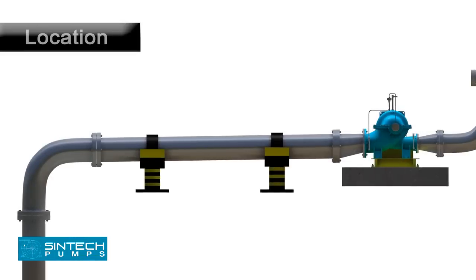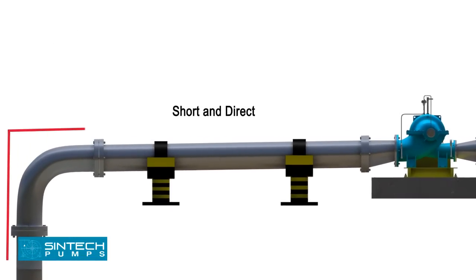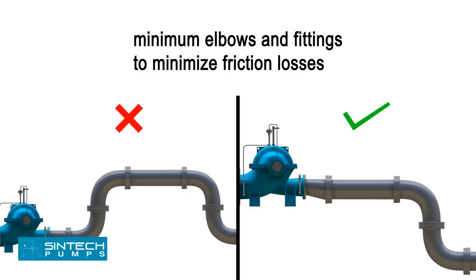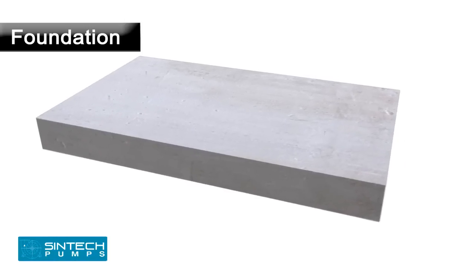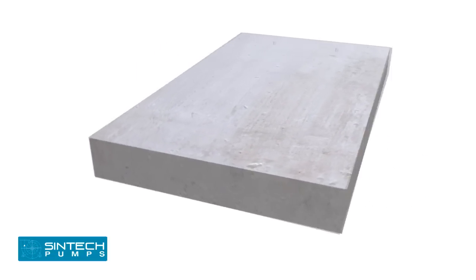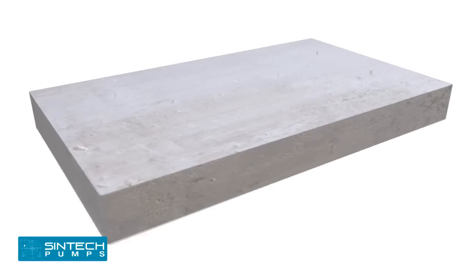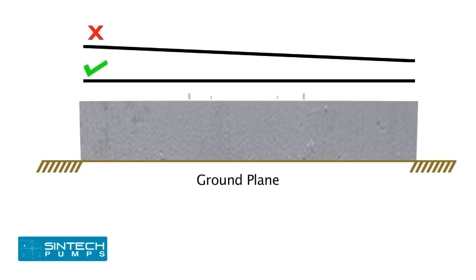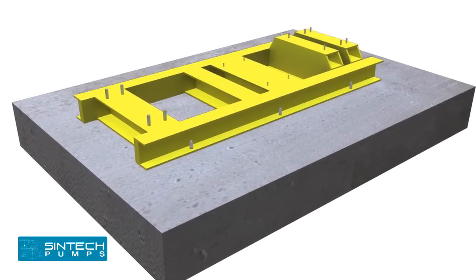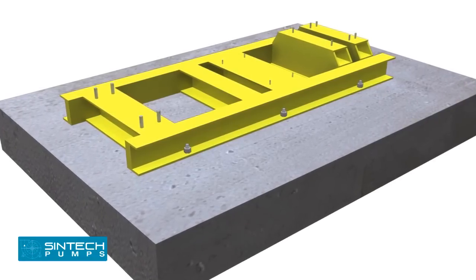Installation. The pump should be located as close as possible to the liquid supply so that the suction line is short and direct. Location should require a minimum of elbows and fittings in the discharge line. Before installing the pump, ensure that the foundation is prepared well — it must be sufficiently substantial to take the weight of the pump and absorb any possible vibrations. The foundation must be absolutely straight without any inclination or tilting. The foundation bolt of proper size should be embedded in the concrete and the base plate tightened, ensuring it is level in all directions.